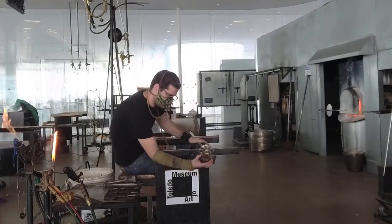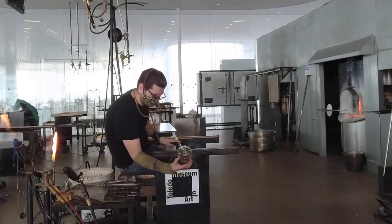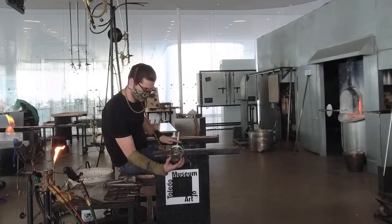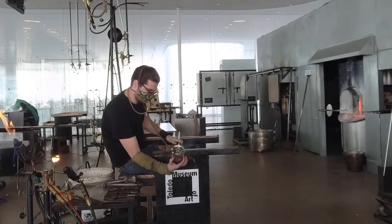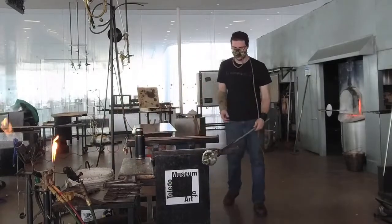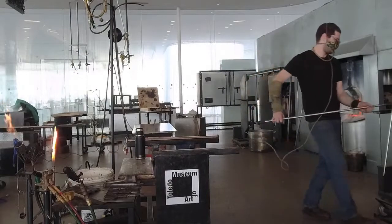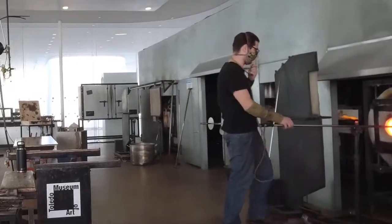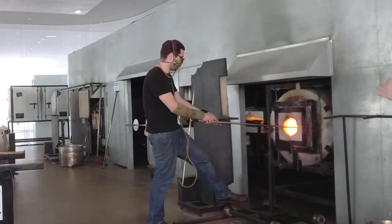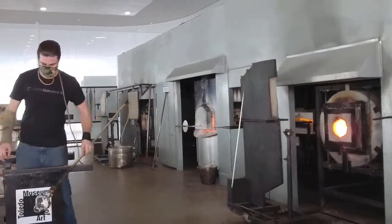And we're going to physically open this up, and George is going to put something called frit in. George is going to put in a special kind of frit that comes from our neon tubing. So frit is basically crushed up colored glass. But in this case, George has taken some neon tubing that was pre-manufactured, and it all has this phosphor coating on the inside, and that's what determines the color of the light. So we're going to put some of that phosphor coated tube inside of our bubble, and once George pumps this with light, it'll be able to reflect those colors.